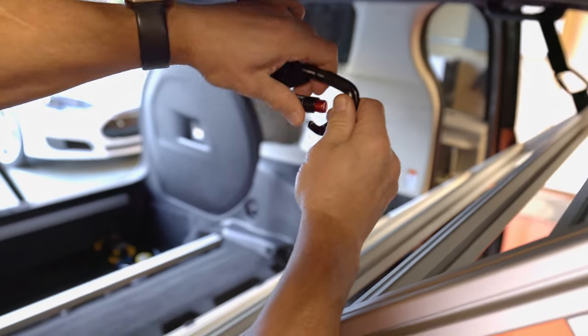Let me show you how I built the floor leveling panel. There are four bolt studs protruding from the frame of the van used for mounting the third-row seats. The lower bolts are at the right height to support a panel that levels the floor in the well. I used small sections of pre-threaded extruded aluminum — cut from the previously trimmed aluminum legs whose center channel was factory-threaded by T-Nuts for M8 bolts — and screwed them onto the seat studs. This provided a way to bolt a floor panel to the 80-20 sections to prevent any potential rattling when driving on rough roads.